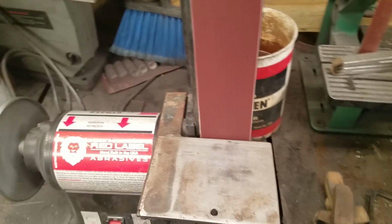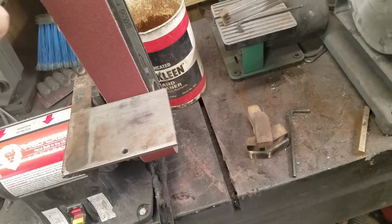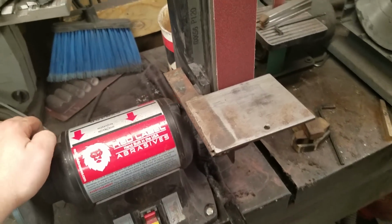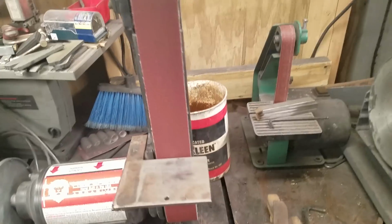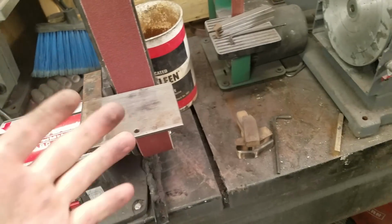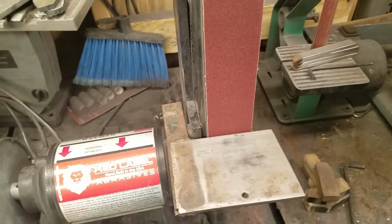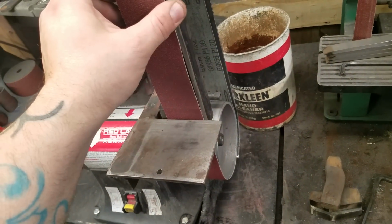Any place that makes belts for the 2x72 can make you belts for the 2x42. It's the same width belt, just cut different and spliced. Most all of these belts, like I think Phoenix Abrasives makes their own belts. I know GL Pierce, that's who I use a lot. They just ask you what length belt you want because they cut their belt material, splice it, and send it out to you. So you don't have to have a certain grinder to order belts from places that make their own belts, because you just tell them the size you need and they cut it and go on.